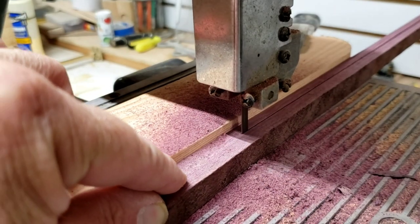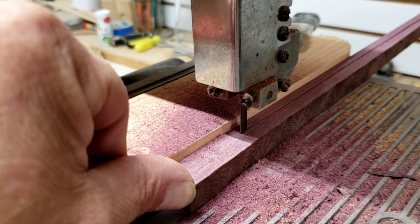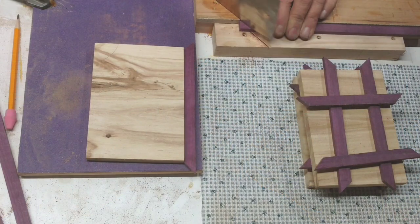We really want to make sure everything is perfect. As I was gluing the trim on my boxes, or on my lids for these recipe boxes, I wouldn't say I was careless, but I let a couple things slip. So there are some noticeable gaps in my miters and on my glue joints. A lot of my exotics I mill up on my bandsaw because it just saves material, and I left a saw cut in a few areas. I also hand cut my miters on my bench with a back saw.